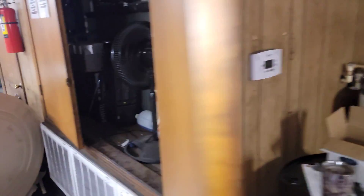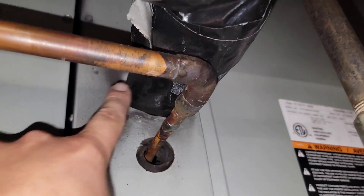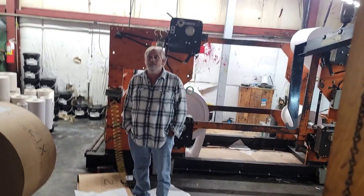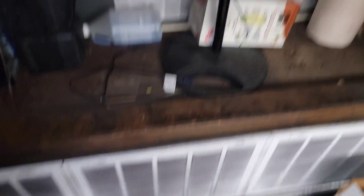There's the thermostat. All these furnaces are twinned together — three five-ton furnaces, three five-ton coils. We're going to cut copper right here and here, and then here and here. Same thing here and here. And then we're going to run it across to our three five-ton units instead of angling it over there. There's the returns. There's the ductwork.